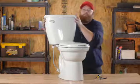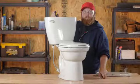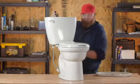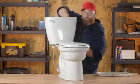After that's done we're going to remove the top of the toilet, and down in the bottom of the tank there are some flathead screws. We're going to grab our pair of pliers — on the underside there's a nut — and grab onto that with our pliers and remove the flathead bolts with our screwdriver.